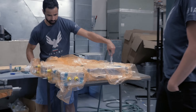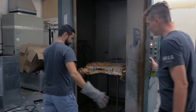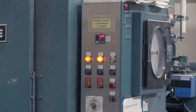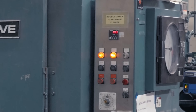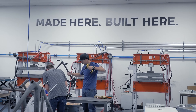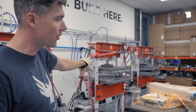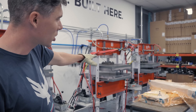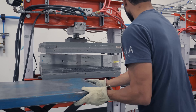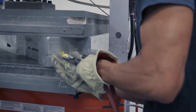We've got it fully envelope bagged. We're going to roll it into this oven, elevate the temperature slightly to allow the resin to soften up a little bit, and apply vacuum to draw air out. After the debulk, we remove the envelope bag and pop into the presses for a final cure. The platens are each heated to about 130 degrees Celsius, and then we apply pressure based on the temperature on the tool.